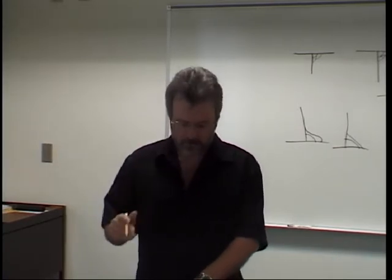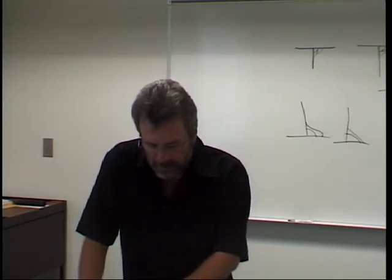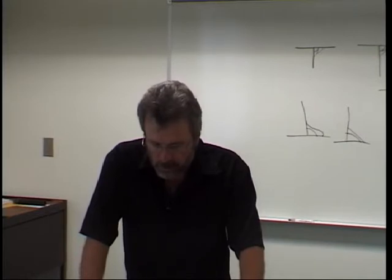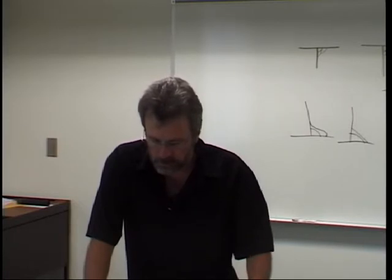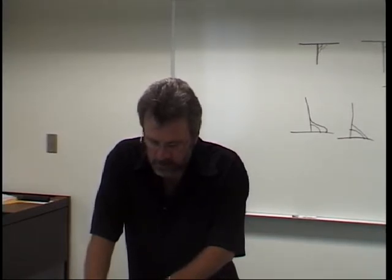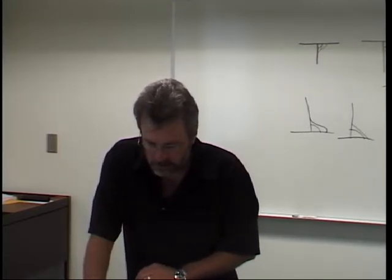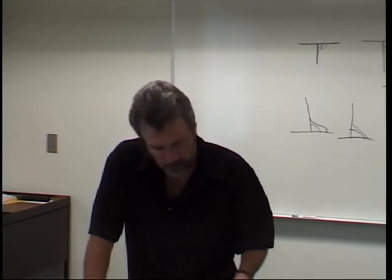It says second pass — the very last sentence: weave the electrode slightly with a whip-like oscillating action. Remember that because the electrode is larger, more metal is being deposited in the crater so there is more slag present. Keep the electrode motion within the limits of the weld size to prevent undercut. Then it says: it is desirable to get more use out of the plate — a third layer may be applied, consisting of stringer beads deposited according to the procedures practiced.